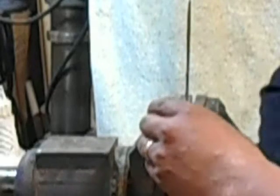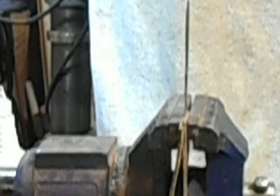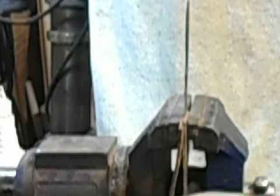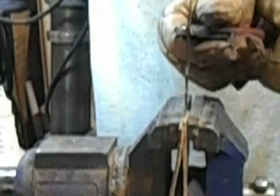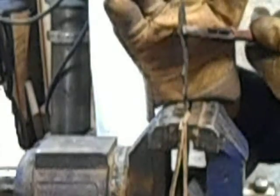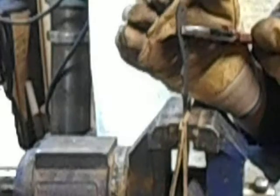Now I was thinking to start with that I would do a soft back draw. Just take an acetylene torch and soften up the tang, and then run it across the spine just to give it a little bit of extra strength. I'll have to go back through the videos and see how far they made it, how many degrees away from a flex that they made before they broke, to see if that's what I want to do. That's why I'm only breaking 3 of these.